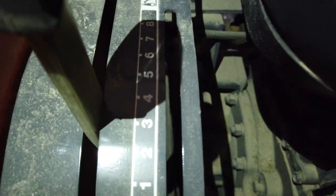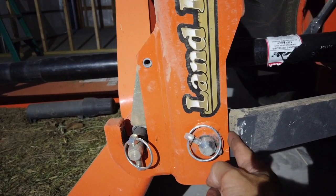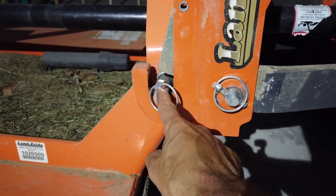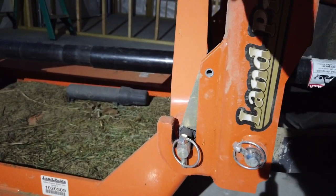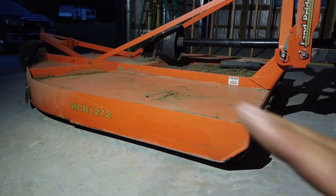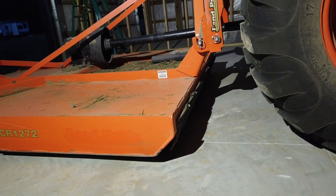With the quick hitch on it, it changed everything. I needed to readjust to put the lever at three — that's the new number. Before I had it at the very bottom to get it low to the ground, but the quick hitch bolt is at a different level, and it's further out, causing a slight angle problem. The deck was angling downward and digging into piles of dirt, hitting the blade at an angle into the mound — that's what caused the shear pin to keep breaking.